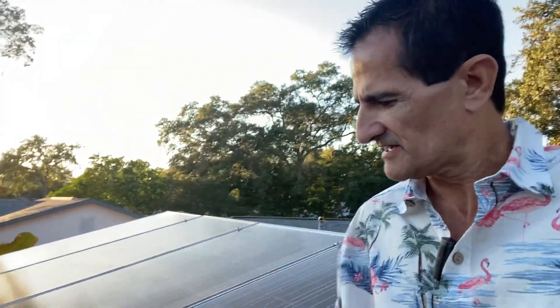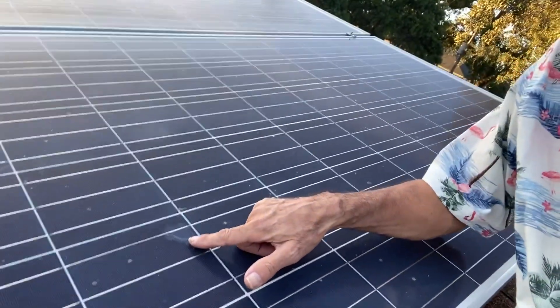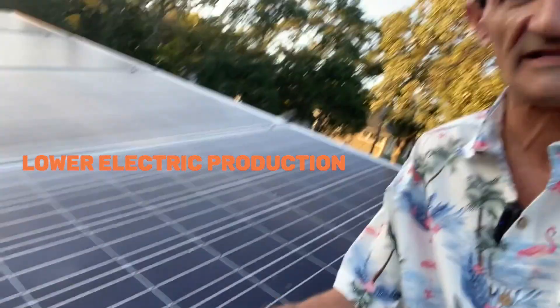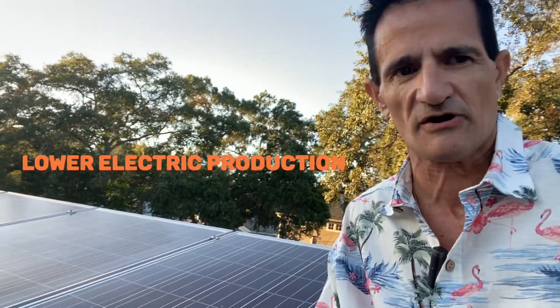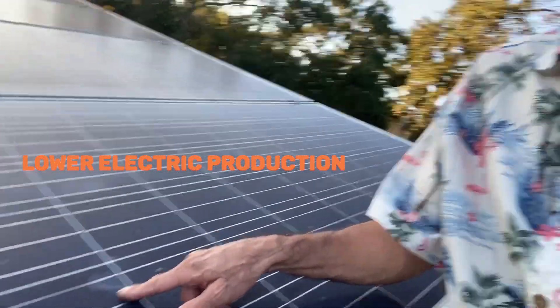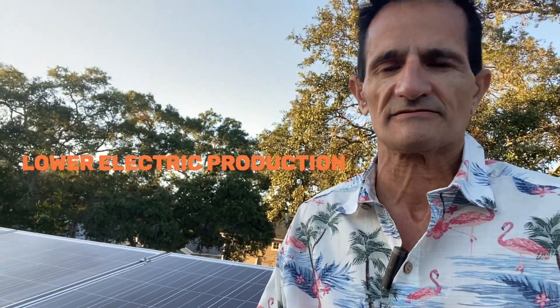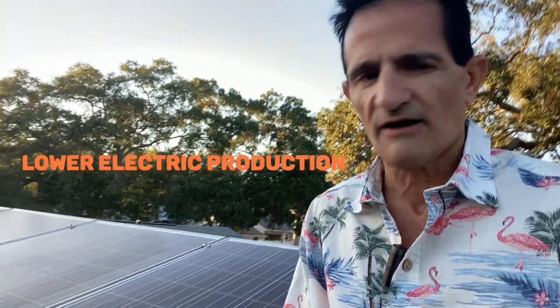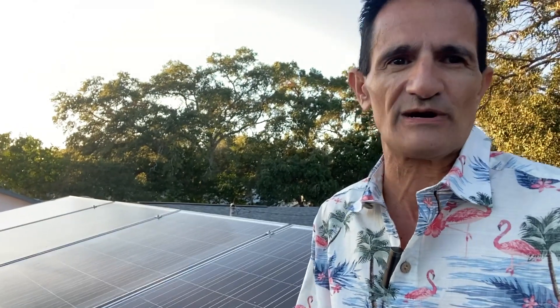I've completed my analysis. Out of 10 solar panels, five of them have defects — problems in the bus bar or snail trails in the solar cells, mainly snail trails where the solar cells are shorting out, and one bus bar I've seen burn out. Once that happens, these panels are going to start shorting out; they could eventually get very hot and possibly cause a fire. I would just recommend replacing them. Again, it's older technology — a 255 watt panel, and we're now using at least 330 watt or better.